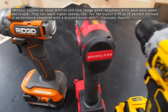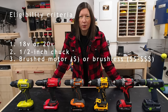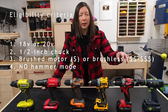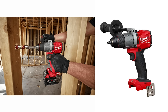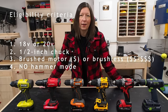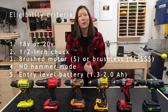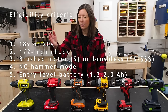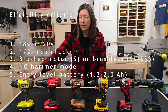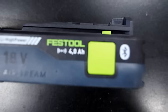Note that you can get a 3/8-inch chuck that'll cost a bit less. The entry-level drills have brushed motors, whereas the more expensive drills are all brushless — not surprising, as the price goes up you're more likely to find a brushless motor. None of these drills have a hammer drill setting; there's a Milwaukee Fuel model that does but I didn't include it to keep the comparison fair. All the batteries are entry-level, between the 1.3 and 2Ah range. You can get batteries that are much higher amp hour, like 4 or 5, and they'll last a lot longer.